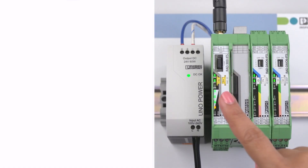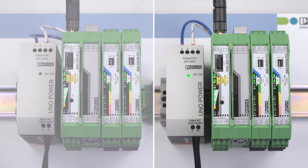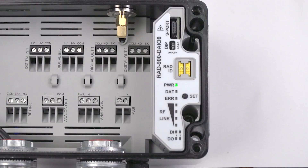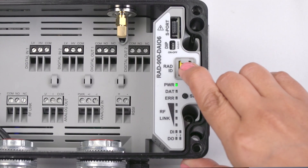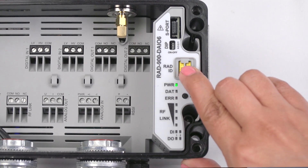Since thumb wheel addresses 0-2 and 0-3 are already being used on the existing system, neither are available for the outdoor unit — 0-2 because it would conflict with the wireless module on 0-2, and 0-3 because it would conflict with the I.O. extension module pairing on 0-3. You must select a setting that is not currently in use. Configure the outdoor radio line module as a slave by using the next free thumb wheel setting in your system, which is 0-4.